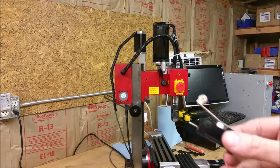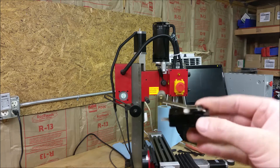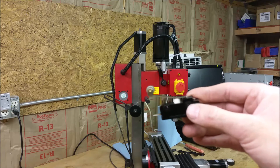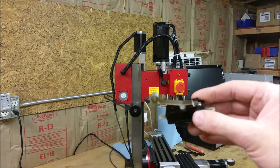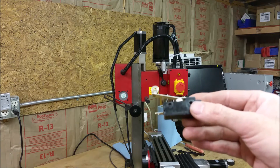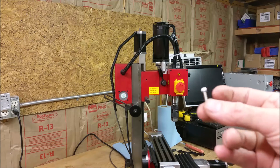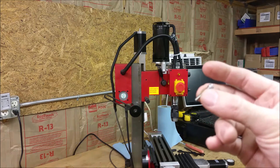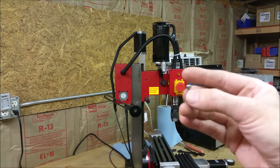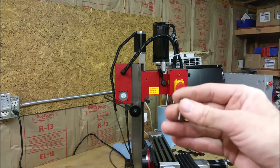The micro switch that I'm using was from Grainger's. I forget how much it was, like six bucks or eight bucks. Probably could have gotten them from eBay for less, but Grainger sends them real fast. I'm using a three-quarter inch long, actually 6-32 cap head screw, stainless steel. I figured I'd use stainless because there's going to be moisture around here.